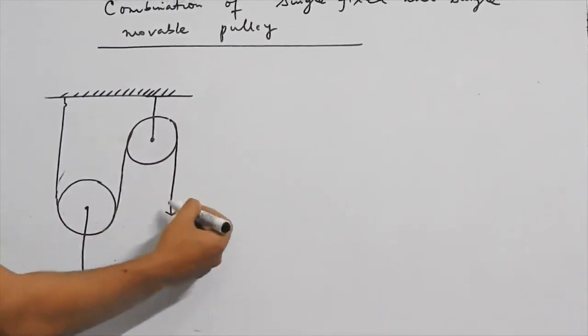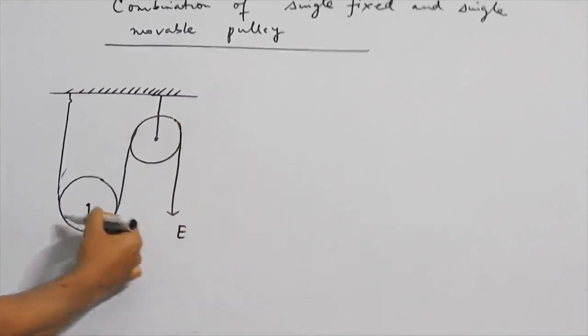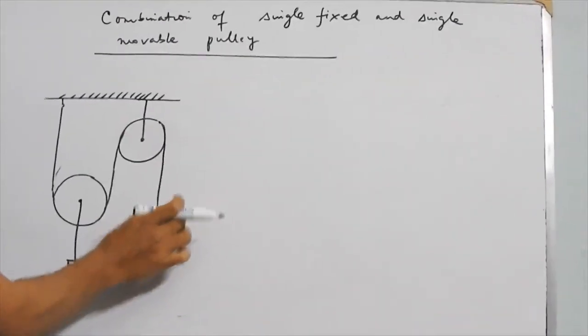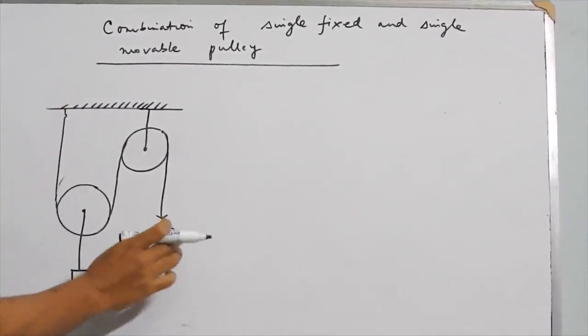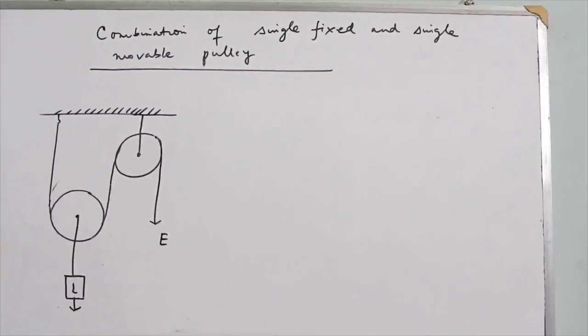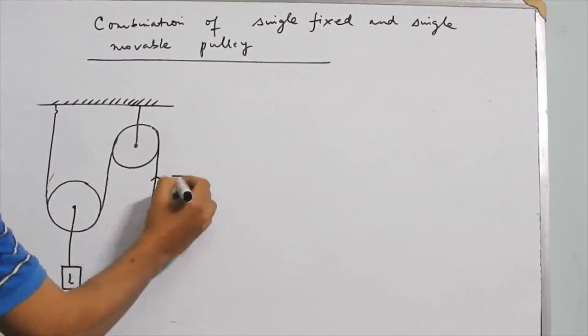So the same string is actually passing through both the pulleys. So now we are applying the effort in the downward direction, which is more convenient, and we are lifting the load by applying a much lesser effort, so that we are getting the advantage of a force multiplier. So now the effort will be balanced by one end of the string, that is the tension in one end